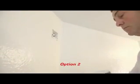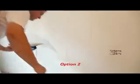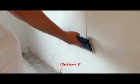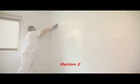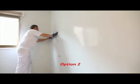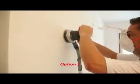The second option consists of passing a spatula once the product is placed on the support. This process requires a more qualified labour, saving material and product's drying time. The sanding process requires a smaller investment in time due to the lesser amount of product finally placed. Because when we have smoothed with the spatula, we remove a large amount of the material previously placed, so the sanding process is shorter.